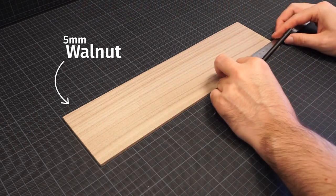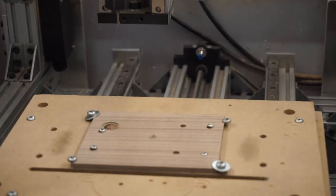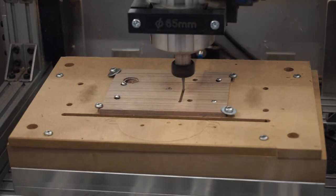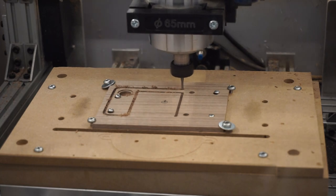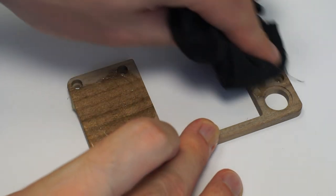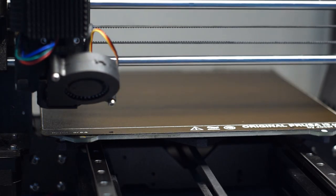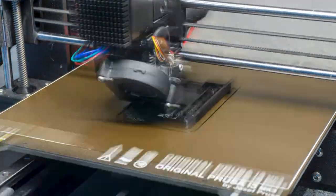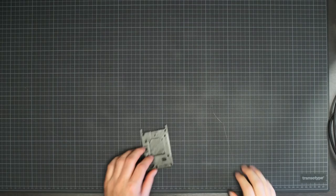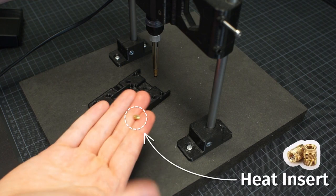Any camera deserves a nice front, so let's start with wood. I'm not one of those people who are absolutely excited about woodworking, so I just use a CNC machine — that's way more precise than my clumsy fingers will ever be. Because it looks quite nice, I'm using a combination of beeswax and linseed oil for finishing. Everything else is plastic — 3D printing is just incredibly convenient. I can design it, start the printer, and do other stuff till it's done. The whole camera is held together by melting threaded inserts into the plastic and screwing it together, plus a few strong magnets.